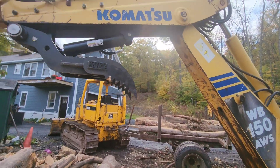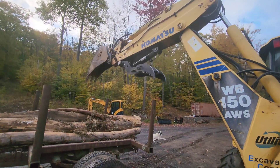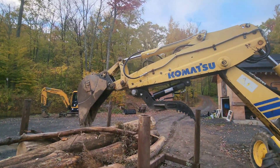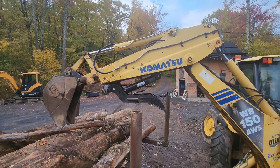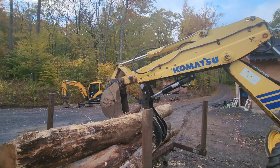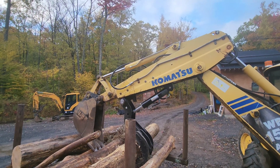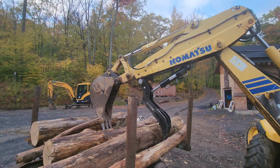We've already gotten some logs off. Now we've got somebody else using the machine to get used to the thumb and see how they do. This is going to be a tough one. I've got the pressure relief a little too soft — a little too light on the return. The thumb goes back, so we've still got to adjust it. That's making it hard to grab.